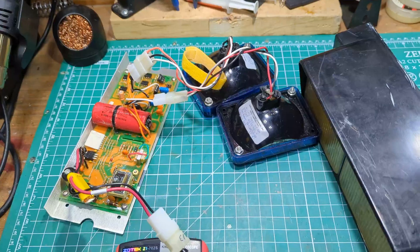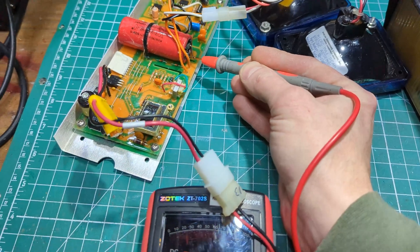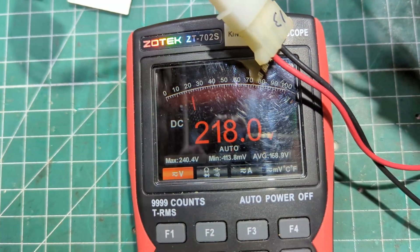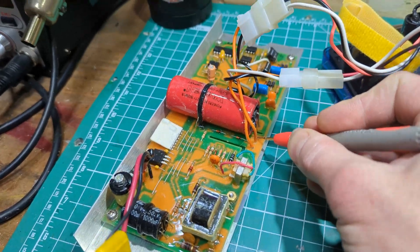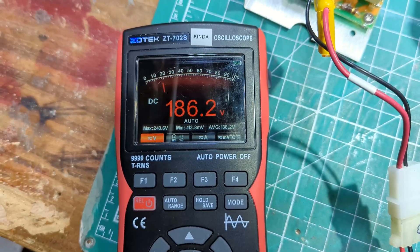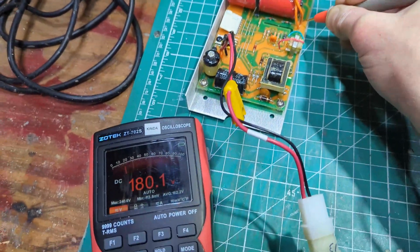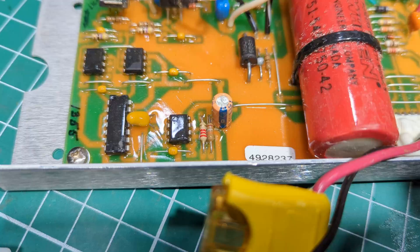Before we do that, let's look at exactly what sort of tickle we're dealing with if we get our hands where they shouldn't be. We're looking at about 240 volts, relatively low amperage DC — it would certainly be uncomfortable, I can confirm. While it probably wouldn't kill you, it's certainly not something you should do. You can see after the device is turned off, we still contain a 185-ish volt charge in our capacitor, and that usually takes about five minutes to bleed off. The device is not on and we still have 185-ish volts remaining in the main capacitor, so this isn't something you can just play around with.